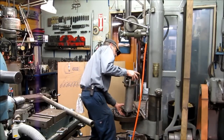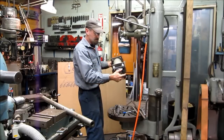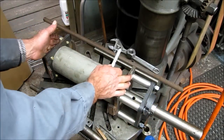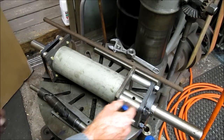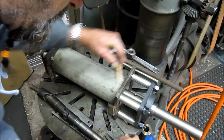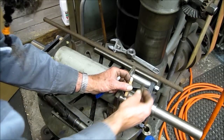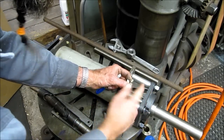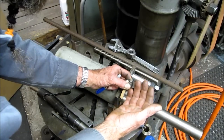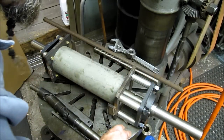This setup could be horizontal, vertical, or at a shaft angle as in a stern tube. Here's your basic setup: you've got your part that needs to be bored, your two bearings mounted on each end, and access to get in and work your tool bit — move it in and out to adjust. You want to research tool bit lead angle, because most boring tool bits have a lead angle to promote tool pressure, which is key to eliminating chatter and vibration. Those are things you work out as you're creating your bore.